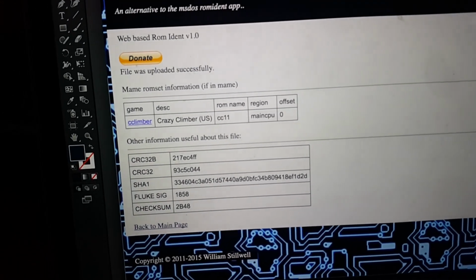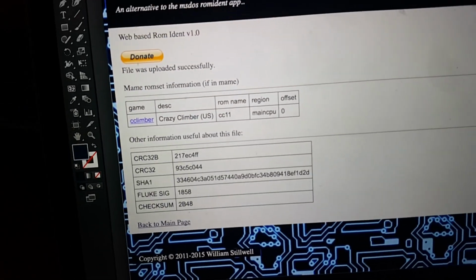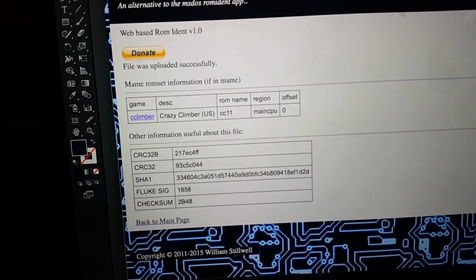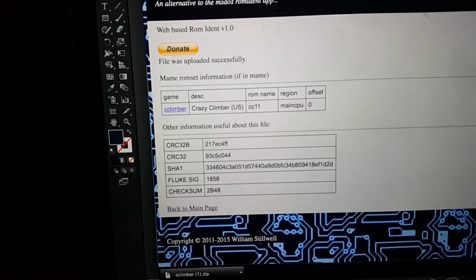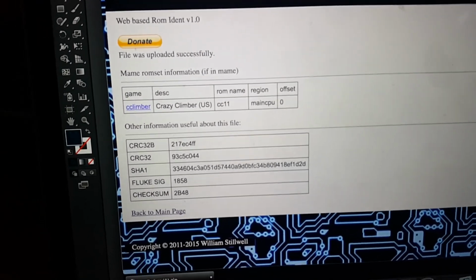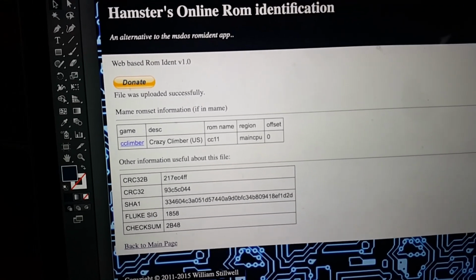So what I think I'm going to do is, just for the heck of it, burn a new EPROM number 6 using a 2532. Is this all making sense, by the way? Because I don't know if I'm getting a corrupted read because I can't select the proper device. That's what I don't know. So anyway, let me get a 2532, and we're going to burn EPROM number 6 for the heck of it and try it out. Because again, one of my viewers said, hey, I had the same glitches, it was EPROM number 6. So let me get a blank 2532, and we'll burn that.